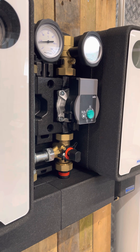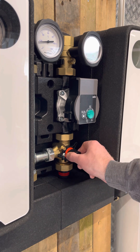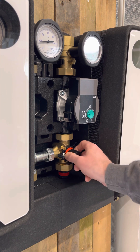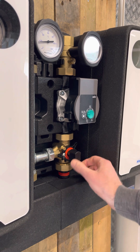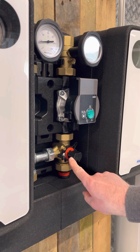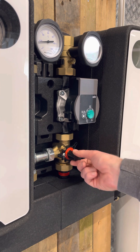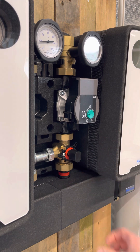If you're fitting the MWR3 actuator to the mixing valve itself, the first thing you'll notice is it comes with a manual cap. This manual cap can be removed, but when you remove it just note that there is an arrow on the actual manual mixing valve itself. You want that in the down position when you're putting the actuator on it.